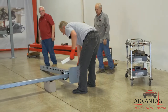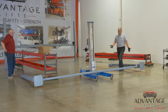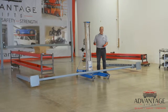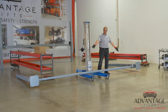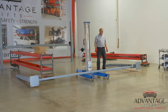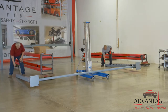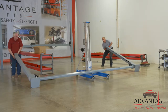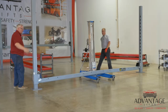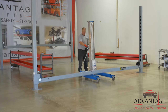At this point we can pull out our stops for the locks so that when we stand this up it goes all the way to the ground. Now that we've got our post in, put your genie back underneath or use the cherry picker with a strap, because you have to raise it up to pull those blocks out of the way. Two guys are going to get on the end of the post and walk this up to where it stands on the base plate. Then just like we did on the other one, we raise it up to the seventh lock.